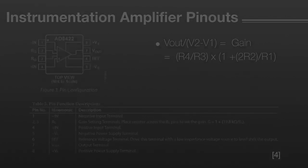Let's recap. Now you've learned how to use an instrumentation amplifier for low voltage sensors that need high amplification, such as thermocouples and strain gauges. In the next video, we will explain some important specs found on amplifier spec sheets and how these specs affect your sensor accuracy.